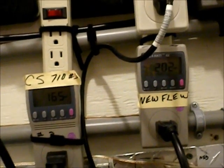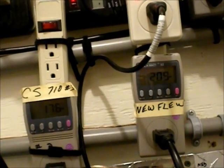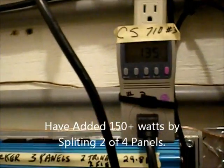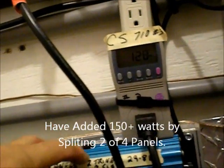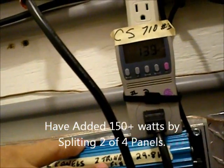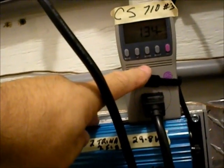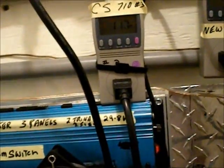Now if I just went up to 600 watts — from a maximum of what I've seen occasionally at 440 — while my Canadian Solars are knocking out 600. Say what you want about these Power Jack units, but there's only 705 watts coming in at 47 volts, and I'll constantly get readings of 620 to 640 out of 700 out of these.